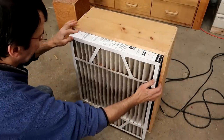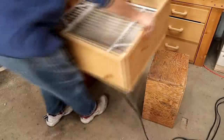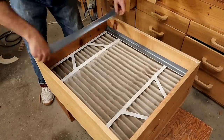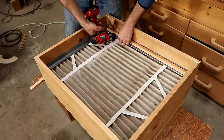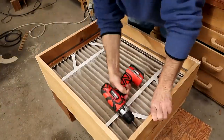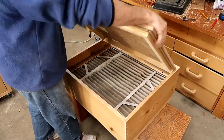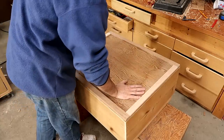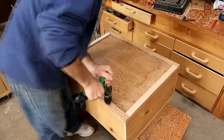The idea is that this filter will get very coated with very fine sawdust, and the sawdust actually is the thing that does the filtering. I've often had problems with blow-by when using filters like that, so I'm using some duct tape to seal it around the edges. I've had bad experience with duct tape not holding very well over time, so I'm adding some wooden rails to hold the filter and the duct tape in place. I've got a lid that goes on this side, and for a seal I'm just using a strip of corrugated cardboard, which is fairly compressible, so when it's screwed on tight that should give me a good seal. I also added some slightly bigger holes for the screw shank and then countersinks.